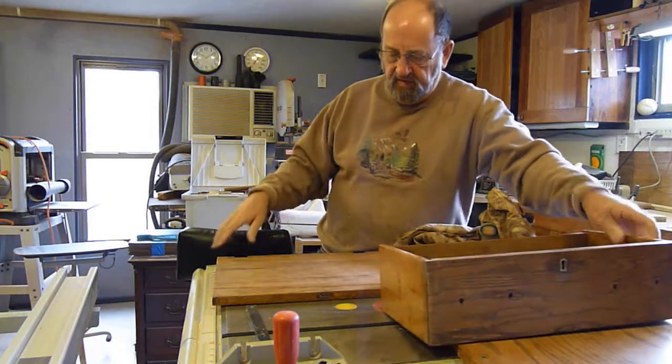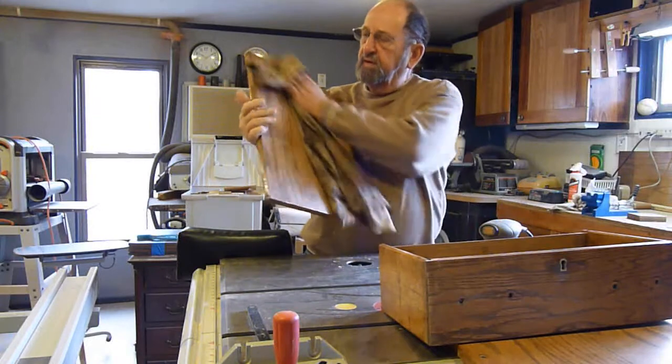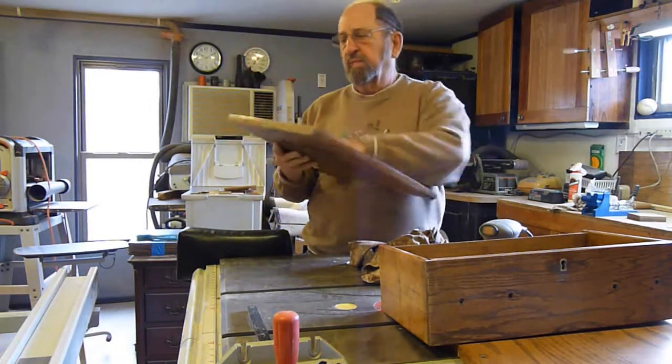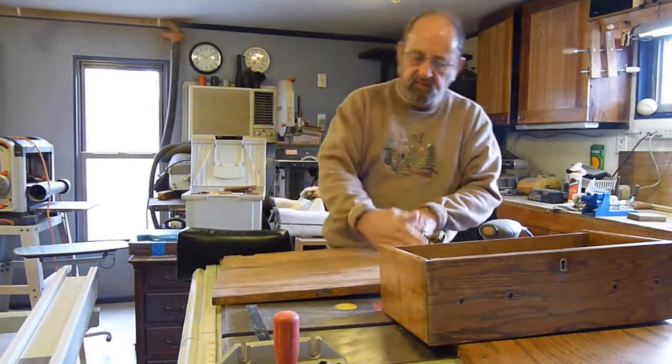This thing shouldn't take any more than two coats because it's already been pretty much finished two or three times over the years, and a lot of that stuff stays soaked into the wood — you can never get it all the way out. Anyway, make sure it's nice and clean, and then she's ready for a second coat. I've done the same thing on these other pieces that I've already finished up, so I'm ready for the second coat on those.